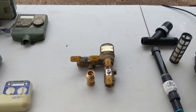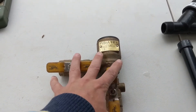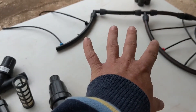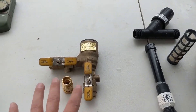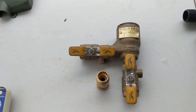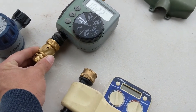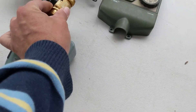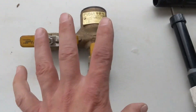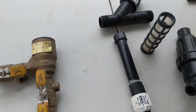The second part of your system — some might call it optional, but I strongly recommend it — is some kind of vacuum breaker or backflow preventer. This prevents debris from your tubing from going back into your plumbing. If parts of your landscape are at a higher elevation than your valves, a backflow preventer is especially important. This type attaches to the hose bib and should always be placed on the downstream side of your timer so it's not under constant water pressure, which would cause it to fail.